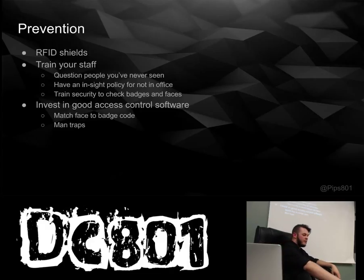So the most common is the HID cards, the Prox card too, the clamshell. Some of them have the HID, some are blank, some of them actually have a company name or whatever printed on it. Those are the most common, at least in the US. Outside of the US, it's some of the higher frequency challenge and response cards. These are just a code. It's a very basic code. That code just gets demodulated over the wires on the radio and sent to the card reader.